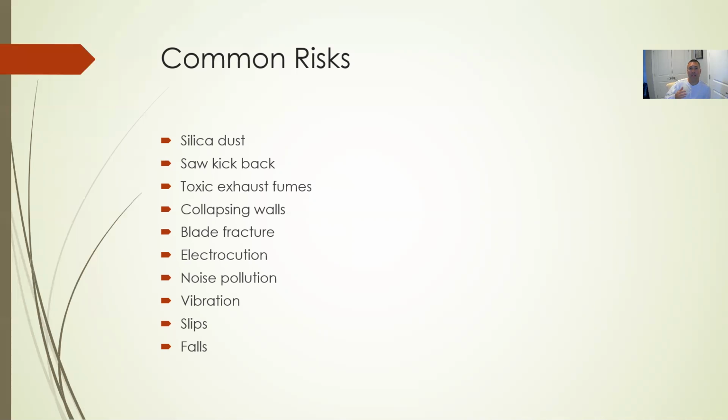Not trying to veer off, but if you have an electrical line that is marked in a concrete driveway, and you're cutting that concrete driveway up, and you have to cut across that line. Technically that line is marked, and 18 inches on both sides of that line is the leeway that they give the person marking the line. So that's 3 feet, right? So you've got 3 feet within that area that technically that line can be. So if you're cutting through that, you don't know those types of things.